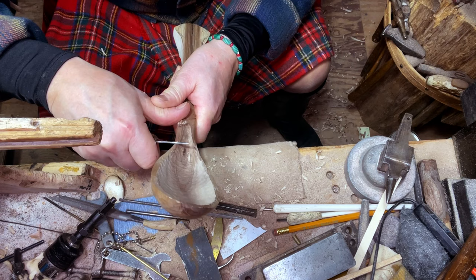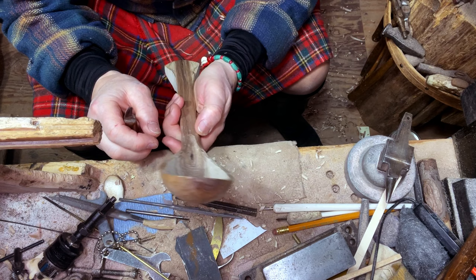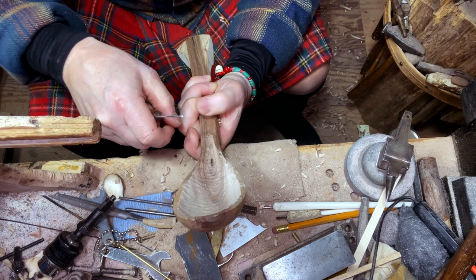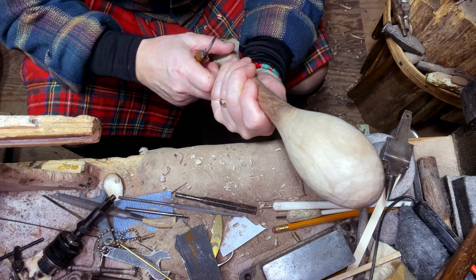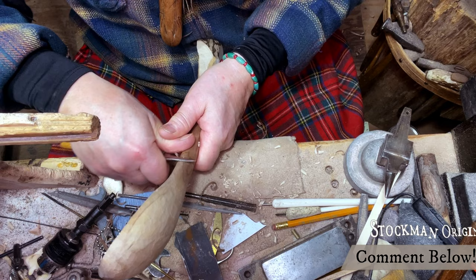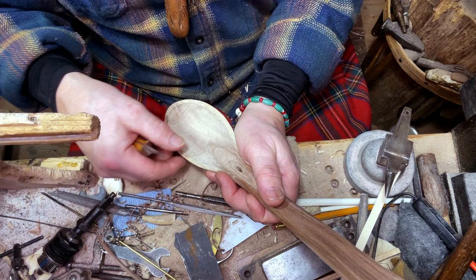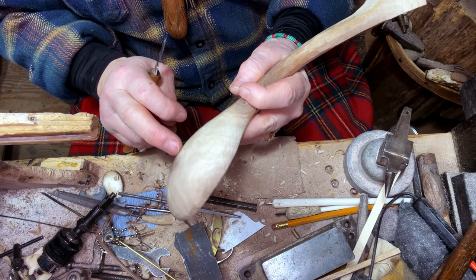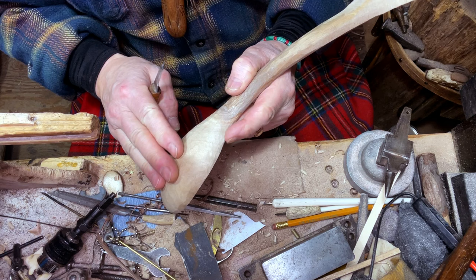This is a pretty little piece of walnut. Generally in older trees you'll find right at the border between the sapwood and the core, sometimes if you're lucky, you get a little streak of what they call purple and blue. This is just a little limb but got a bit of that bluish color coming in — it's going to be a pretty little thing. I'm going to scoop it with a gouge or a carving hook to smooth it up. I probably won't go much more than 320 sandpaper, because you really can't get much smoother than a nice sharp knife cut, and I like the tool marks left on it anyway.